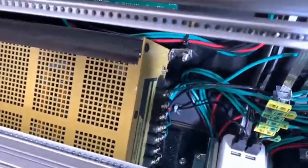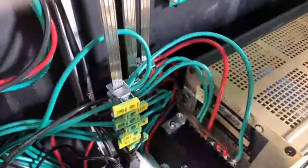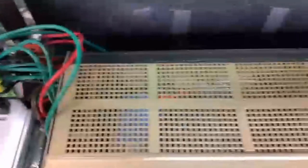But something else I discovered when playing around with power was these power supplies. These big linear Cosel gold boxes, or even the little Meanwells you're using for your portable case, or the Meanwell cages that go inside these systems, they all separate the ground from your mains earth, from the ground on the power outside. And they do that so you can do tricks like I'm running this power supply backwards. Its 12 goes to my ground, and what's normally its reference zero goes to the minus 12 lead. So I can go ahead and have minus 12 out of this power supply.